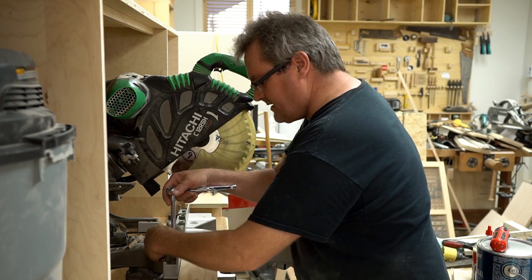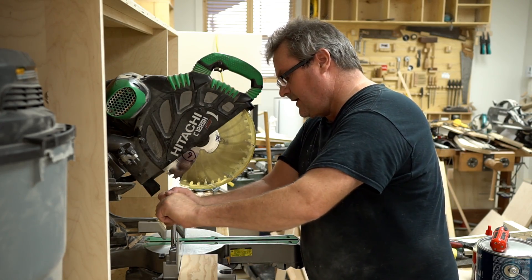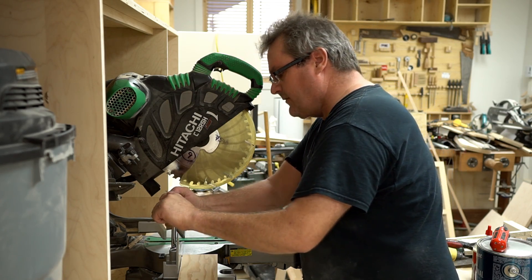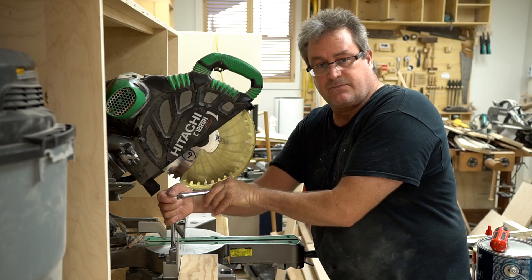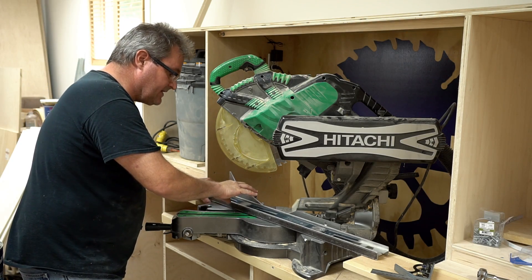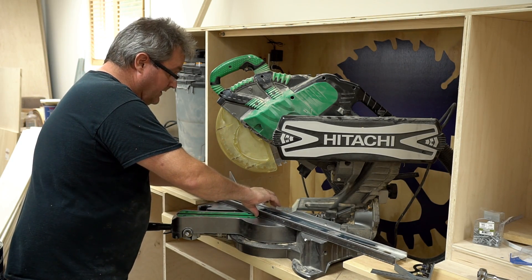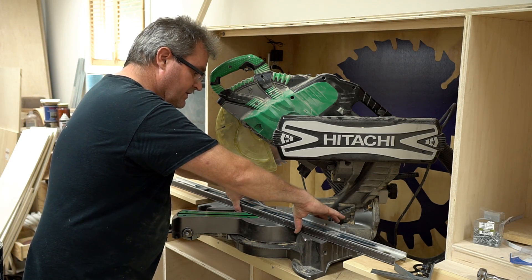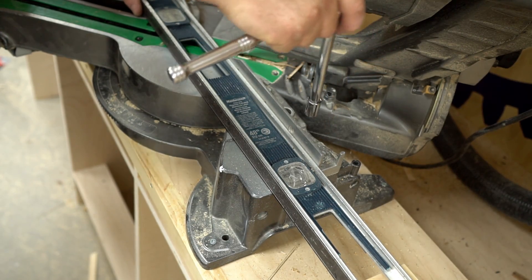I'm going to take my ratchet and tighten up that bolt so that this position gets locked in, and then I'm going to test it again — because when you tighten the bolt the fence can move a very small amount, and it's always a good idea to test it again. I'm going to make these bolts as tight as I possibly can without stripping them — I don't want this to move. With this side of the fence done, I can line up the other one. I've got a level that is as close to a straight edge as I have, so I'll hold that tight against this fence, move this one over until it's flat against it, and tighten the bolts while watching to make sure it stays lined up.